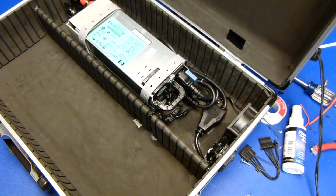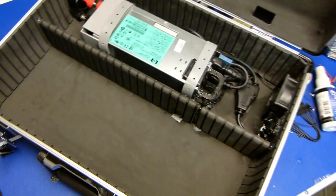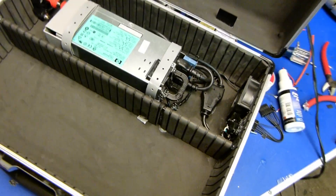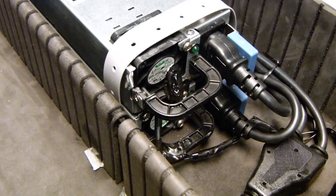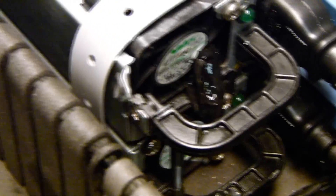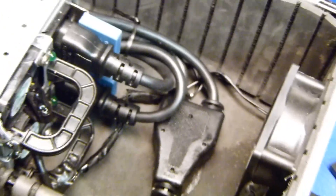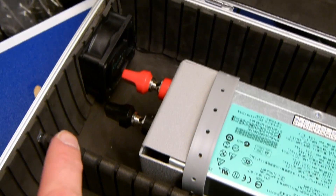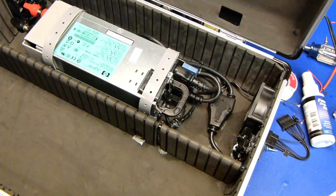Okay, charging station update. I had a problem because the fans were not 24-volt - obviously the fans I got are 12-volt. So I had to find a way to get 12 volts to the fans. What I've done is I tapped into the existing fans on each of the 12-volt portions of the power supply. I spliced into the wires and tapped out for both of them. I've got 12 volt there and 12 volt over there, and ran the cables behind.